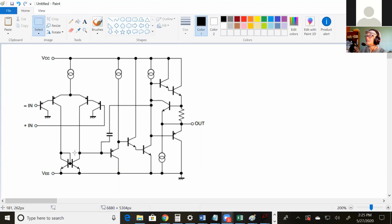It's a technique that actually increases gain, and you can only use it if, right here, it's a differential input, so it's two inputs, but it's a single-ended output. So only one of the outputs is being used. And if you're only using one output, this is a great way to increase gain and get rid of all the biasing circuitry that you would have needed for those NPNs. Okay, that makes sense.